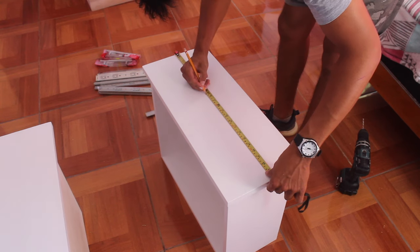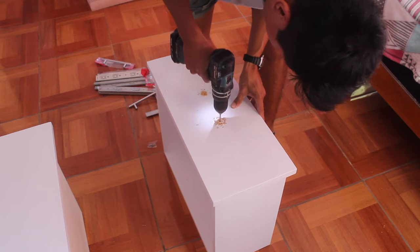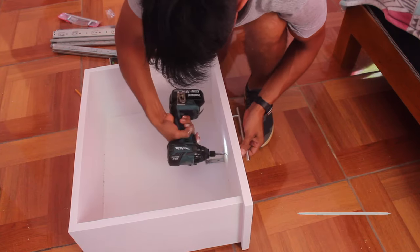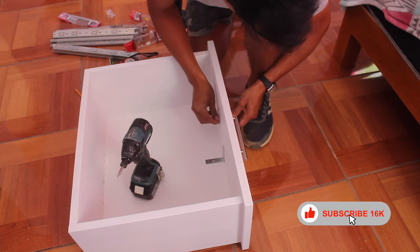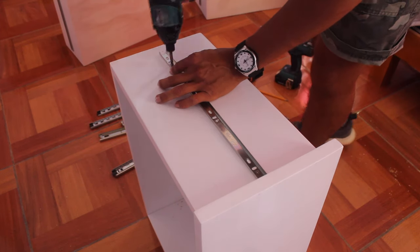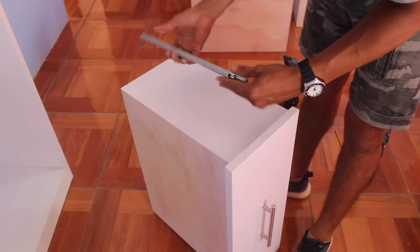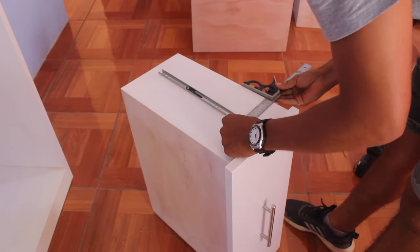On the next day I install the drawers to the wardrobe. The first thing I'm doing is installing the drawer handles — I locate the holes in the center of the front and screw the handle from the inside of the box. The L-shaped bracket is not painted because I removed it before applying the finish. The next step is to attach the drawer slides right in the center of the box sides. I flip it over and install the other side. I'm using ball bearing slides, so I press the lever release and pull out the side I'm attaching to the drawer box.